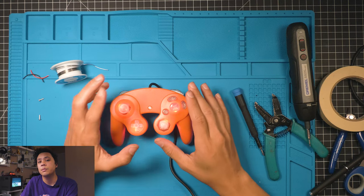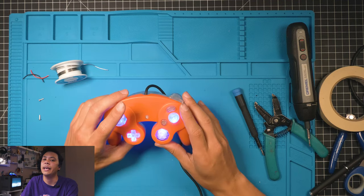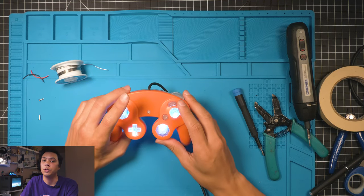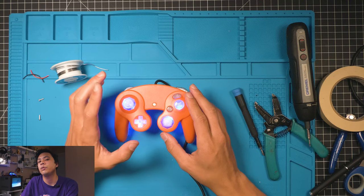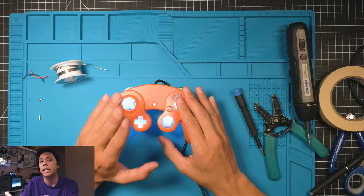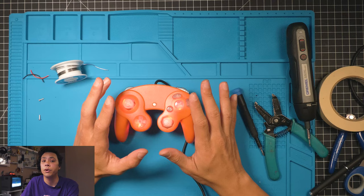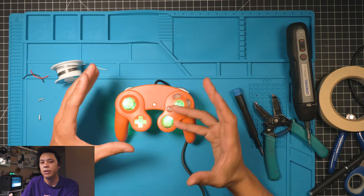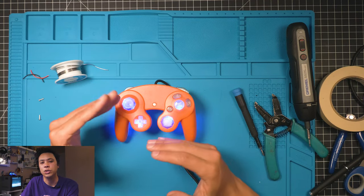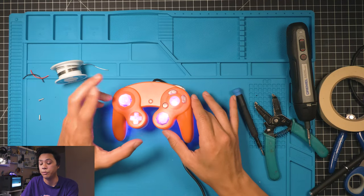One thing I do want to note about this mod specifically is that if you play Ultimate, make sure that you are always using an official Nintendo GameCube controller adapter. The only other GameCube controller adapter that I've used that has worked consistently without any hiccups with this mod is the Panda Global adapter. The Mayflash adapter or any of the cheap third-party adapters on Amazon or eBay, they have issues with, I don't know, the voltage that they give out, and it can either cause misinputs or just totally fry the controller, honestly. But yeah, if you use an official controller adapter, you shouldn't have that problem.